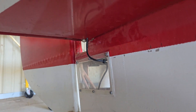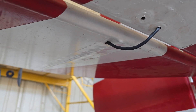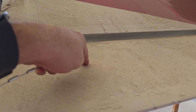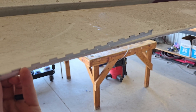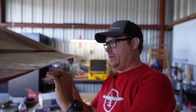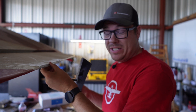I have my trim tab wire coming out right there, running into another little drain hole, coming across and out through a small hole — I'll put a patch around that so it doesn't expand — and that runs all the way back. The other wire is hanging down ready for the servo. Now for the aileron installation behind me, we've got to drill a bunch of holes. There's a flat version and a curved version of the hinge, and I'm using the curved version so it adheres to the curve of the surface. I initially had the orientation wrong, but once I removed the hinge I realized it needs to be mounted the other way — no big deal, just drilling from the top.